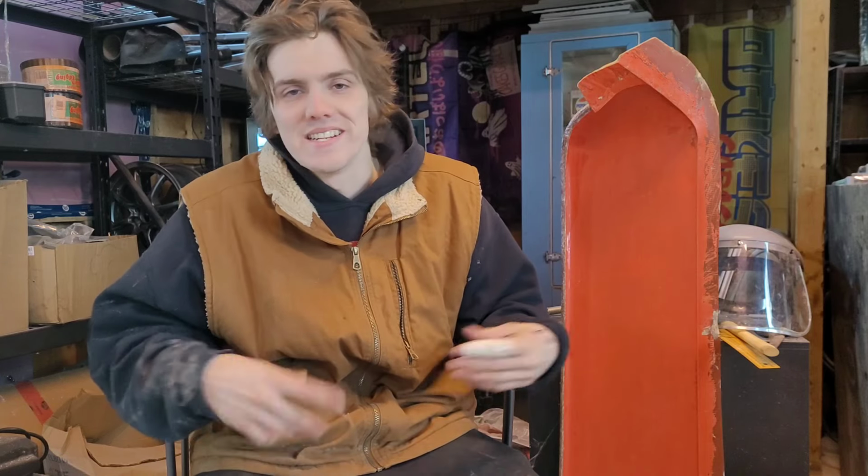So, now that we got the mold finally done, we can go back to what we did last time to make this mold. We'll start with the wax layers, and then we get the glue layers down, the PVA, and the honey wax. I think we do 8 layers of honey wax. I did them over, like, throughout one night, kind of playing games, just taking a break in between it all.